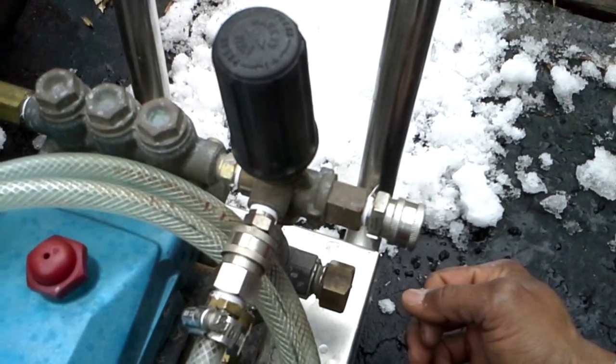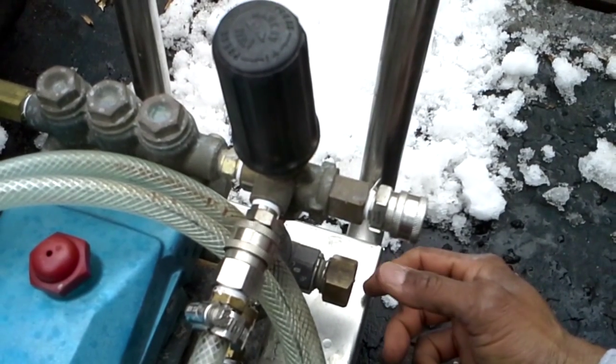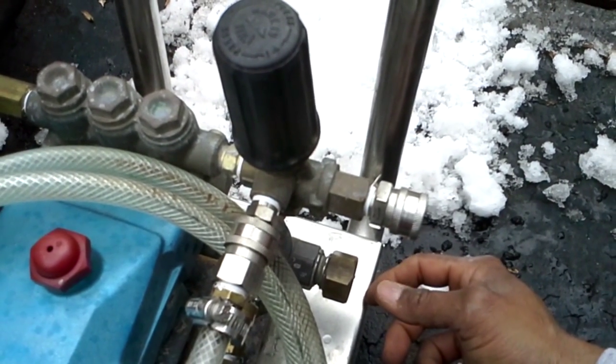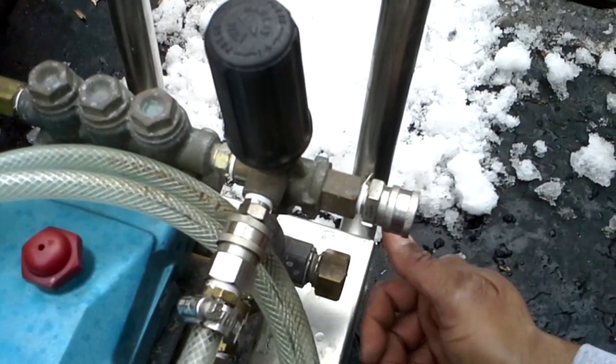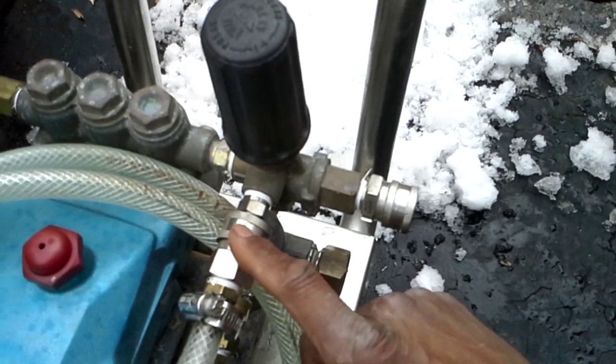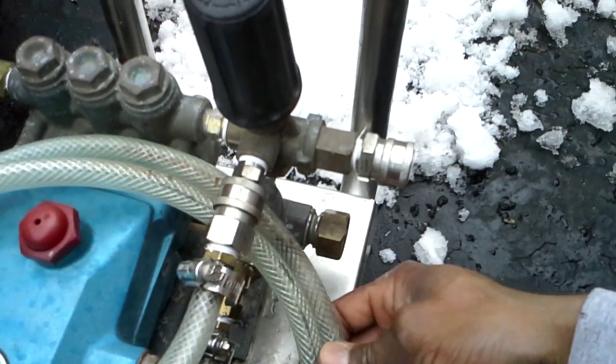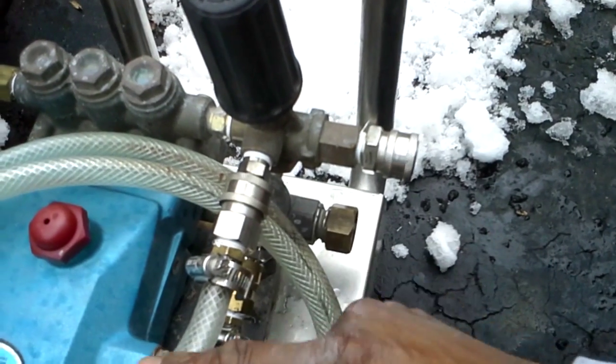When we remove the supply line, we may or may not have antifreeze washer fluid or air available. So we disconnect that, and what will usually happen is you're going to have water trapped in the unloader line, since it doesn't go back to the tank if you have a closed loop unloader.